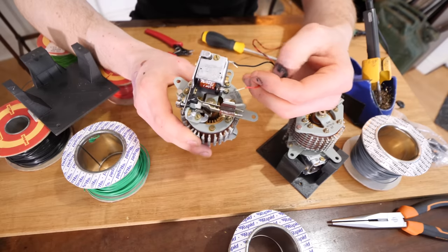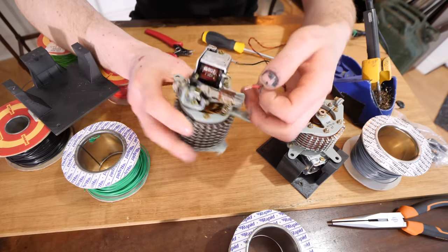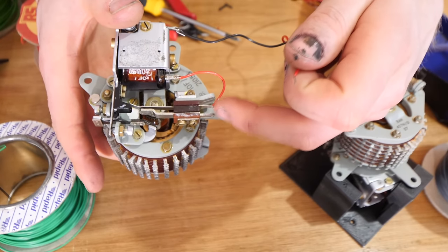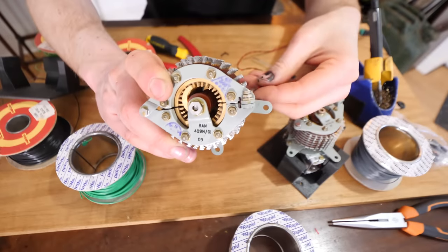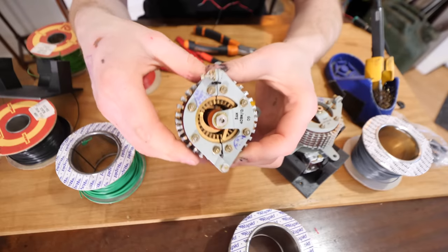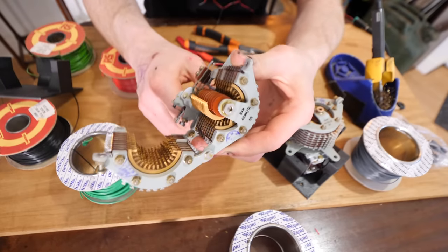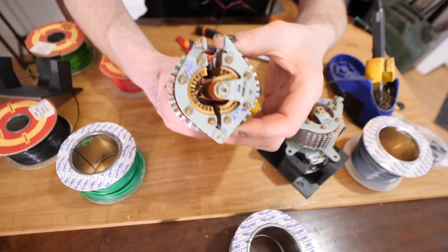The first thing we need to remember is if we put electricity through it, it'll just clippity-clippity-clock along. Next, if we wire in the interrupter switch in series with this, it'll actually just go off automatically. Next, we need to remember that each of the Uniselectors has 30 contacts around. So every single rotation selects between 30 contacts.